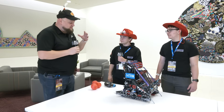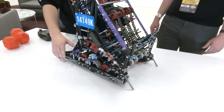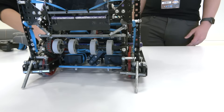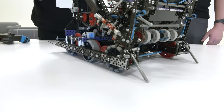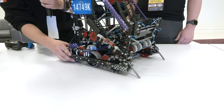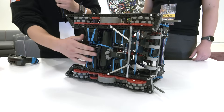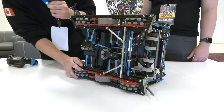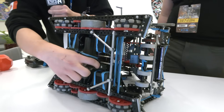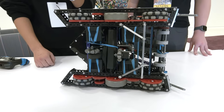Ludo, let's start talking about this robot here. Let's start with the drivetrain and we'll kind of work our way up on some key aspects of this robot. So we have the same drivetrain from Lobster Bowl — a 6-motor drivetrain on 3.25-inch wheels. We have a pretty low center of gravity to make sure the robot doesn't tip. We have all of our weight pretty low for the drivetrain — for example, our battery is here. And for our odometry pod to track our position on autonomous, we have a pretty cool design. We cut our channel here and it's like a screw joint for our odometry pod, so it takes very little space on our drivetrain.